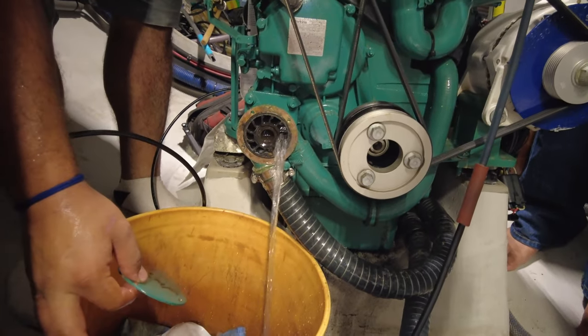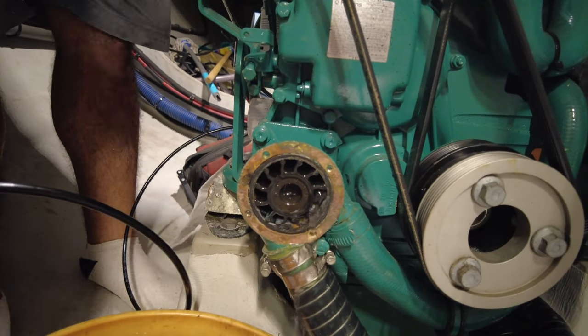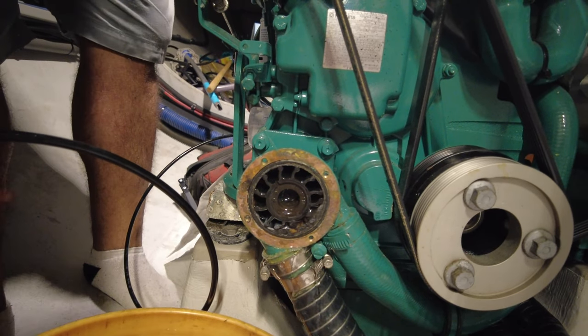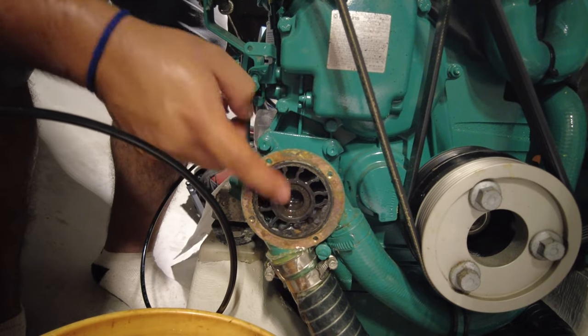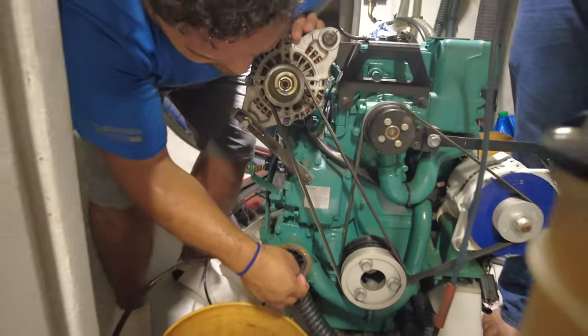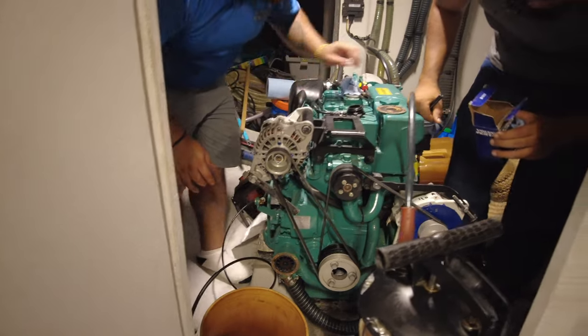You can also see which way around the teeth go — that's actually an important thing. Having spoken to these guys, Alejandro, who is this guy's boss, said it is very important which direction you put the teeth, because they can fracture if you put them in the wrong way at the beginning, especially when it's dry and it just starts off.